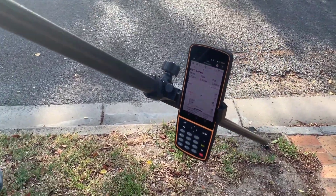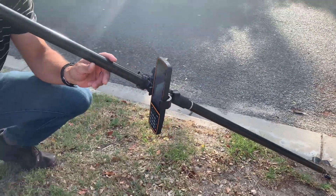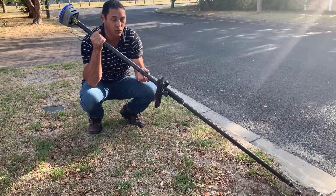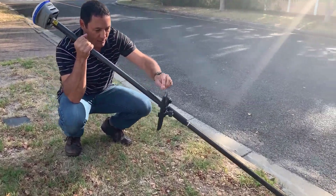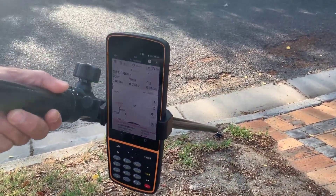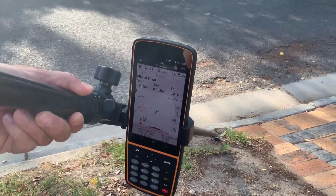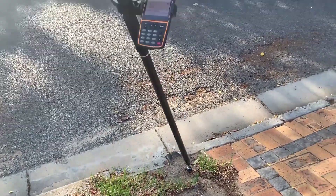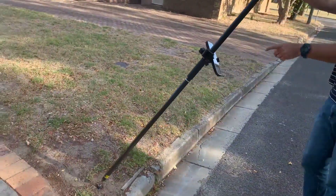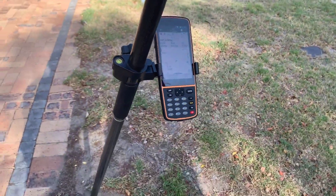You can see the accuracy is still pretty good. We're now almost horizontal. I'm going to move the pole off the point — look at the accuracy there — and putting it back in. Still two centimeter accuracy. Off, back in. Just doing an accuracy check in a different direction — still one to two centimeters. Now I'm taking it into the next quadrant.